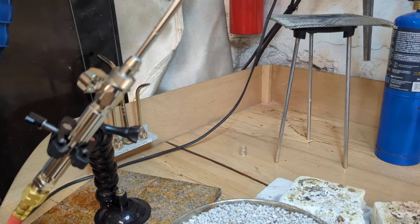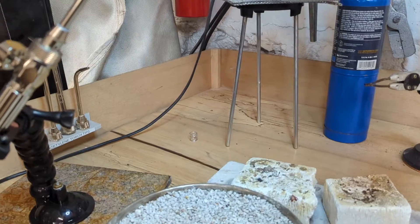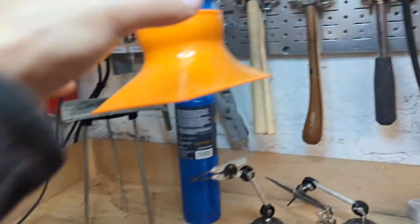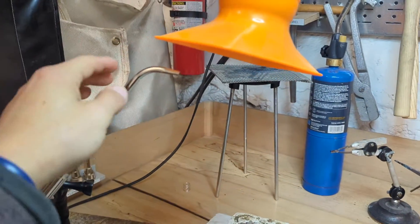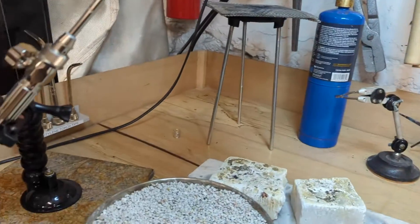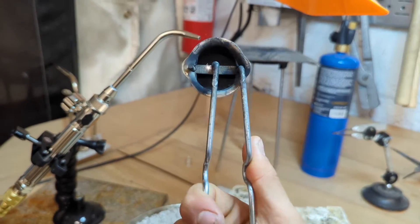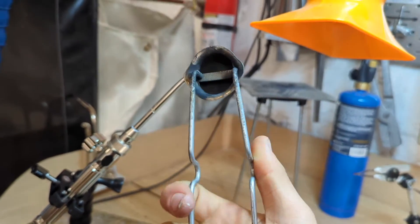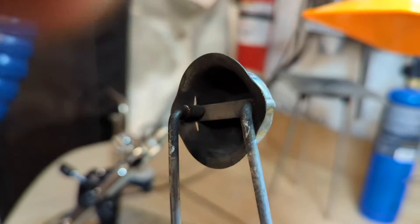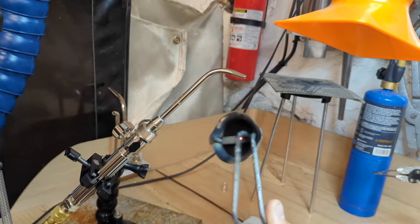You obviously don't want to use this tool on anything with coatings, as they're going to burn off and make nasty fumes. But even just when you're using it normally, it will make some gases that you don't want to be breathing in — that's why we have this vacuum here. So we're going to put this here so that it can get the smoke out. To use the sparker, you squeeze the handle. You can see when I just squeeze it, it doesn't make much sparks. What you need to do is also pull it down so this little piece of flint gets pulled against the striker. When you do that, you can see it makes more sparks.